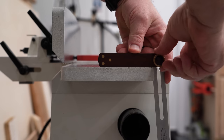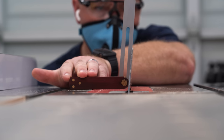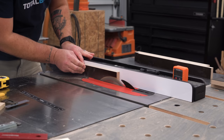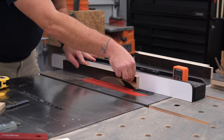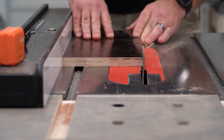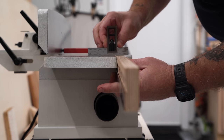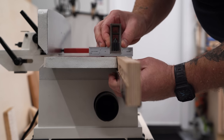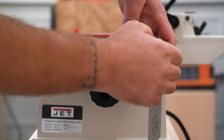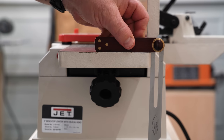The sides of the factory tables are not 90 degrees, so I used a sliding t-bevel to determine the angles and then tilted the blade on the table saw to match that angle. Then I could cut about a blade's width from one side, a little deeper than the stock table is thick. I also cut the mating side of the extension table piece to match that same angle since the blade was already set up at the correct angle. Now the easy way would be to cut the angle off the top of the brace instead of off the inside, but I want to be able to drill a hole straight into the brace to mount it later on, so doing it the hard way now will make life a lot easier later.